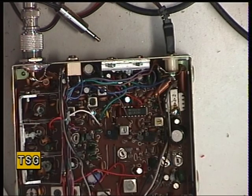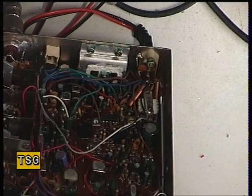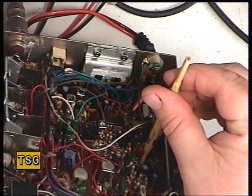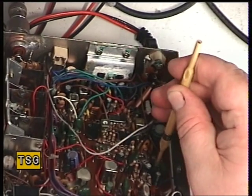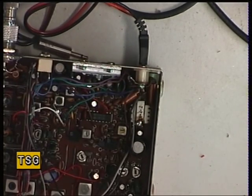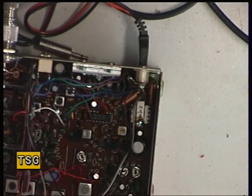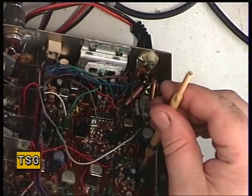While it's in the four watt mode we'll just check that the meter reads four watts. The transmit meter adjustment is the preset just there. We're going to transmit — it's in the middle of the red zone. We're on the wrong preset — I've shown you which one it is. Now we're just clean. You never know with radios this age whether they've been in a smoking environment, and it really plays havoc with anything electronic. There we go, that's spot on.